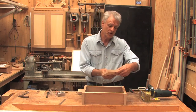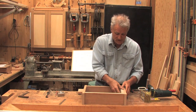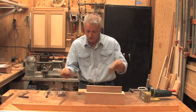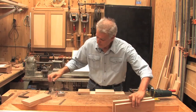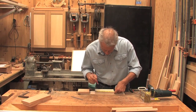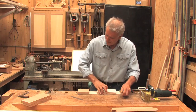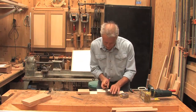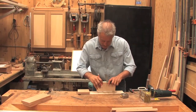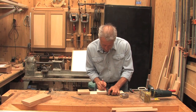As you remember, the joinery block, which is 7 3/4 of an inch, will be placed right in the middle on either side. I need to do some middle marks and use the middle marks as a reference. So 7 3/4. Be able to make a line here and bring it around to the side and up to the top.